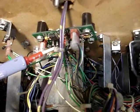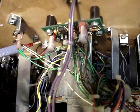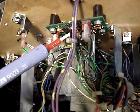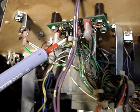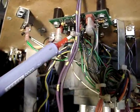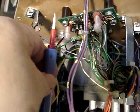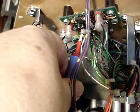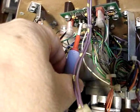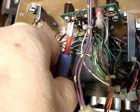The pot has to be set so it'll sense the ball when it rolls over the eddy sensor. There's a little LED on the board — when you fire the game up, that LED should be on. To adjust it, take a screwdriver — I like to use a non-metallic one, but you can use a metallic one as long as you don't short anything out — put it in the pot and back it off counterclockwise until the LED goes out.